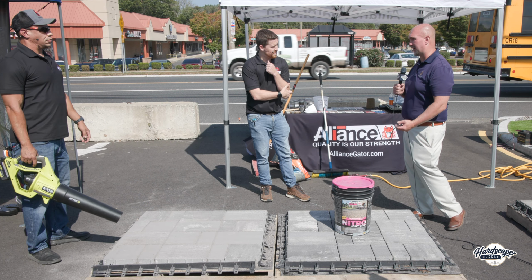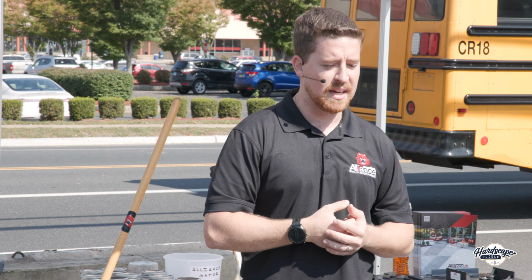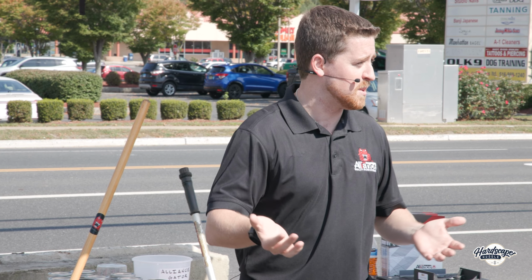That's where most of the mistakes are. How many jobs do you go on where you see they're overfull? A lot more than there should be. A lot of them say, hey, the homeowner likes it that way. I said, no, the homeowner's paying for a paver. That's a 3-dimensional thing. If they want it flat, they might as well just pour concrete.